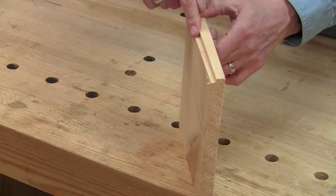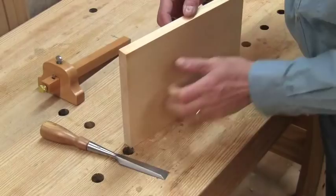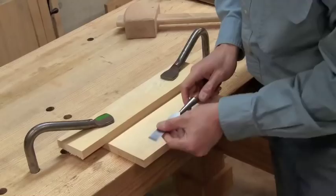This is one of those tasks that shows off the amazing versatility of the chisel. So we're going to start off with the marking gauge, marking out the dimensions of our rabbet. Mark it in the edge and mark the other dimension in the face.